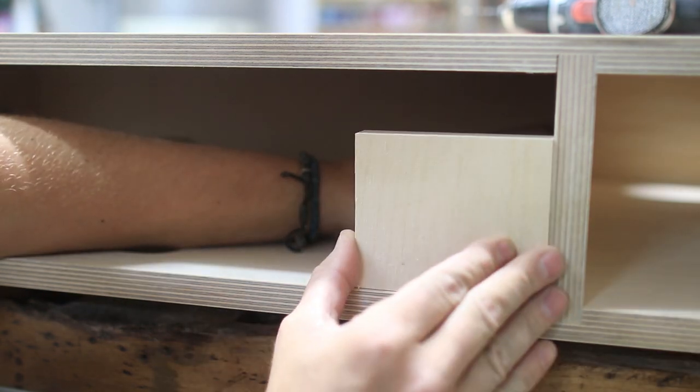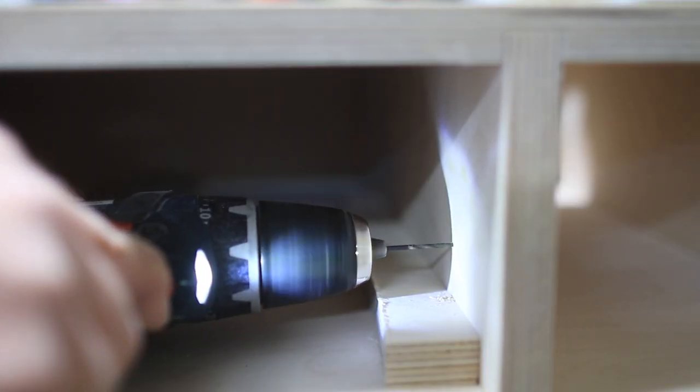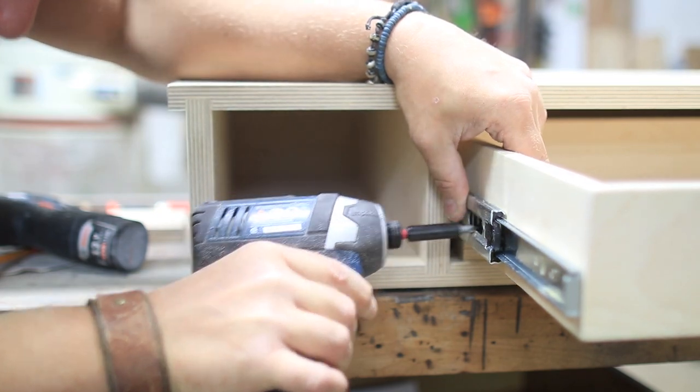Since the drawer is going to have an inset face, I used a scrap piece of 3/4 inch plywood as a guide to set the depth location for my drawer slides. And these are 14 inch soft close slides, link in the description.